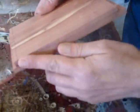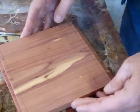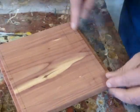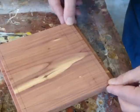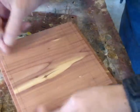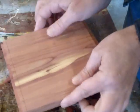I don't have to buy wood. I've taken a couple of pieces of that cedar, sandwiched them together, and stuck them together with some carpet tape. I've drawn out a grid here. I want to have the bottom section six inches wide and then come up to three-quarter inches in on the top, so it's going to be angled a little bit.